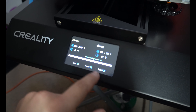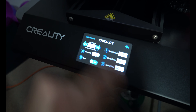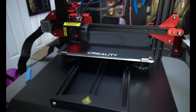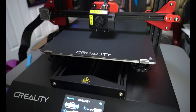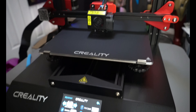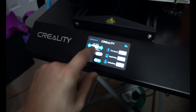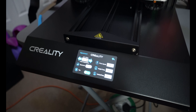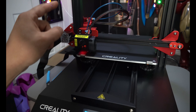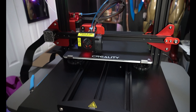I like this layout a lot better. Energy saving mode is on — we're going to go into adjust and turn energy saving mode off. What that does is after a couple layers it automatically turns off your bed heat. Your print can come loose depending on the type of filament and your level of adhesion. PLA typically needs to stay hot on these beds. My Z compensation is already negative 1.5, so somebody already calibrated this printer — I'm starting to wonder if this was already used. But I'm OK with it. It's going to go through and do the 25 points again.